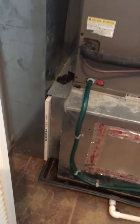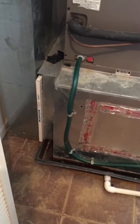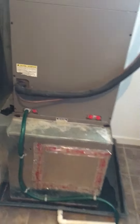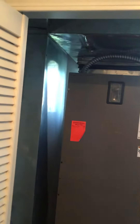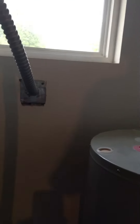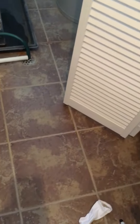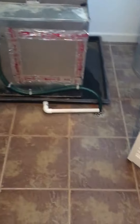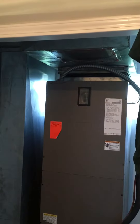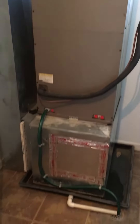There's a spacer in between here, air handler canvas connector, 15 kW, coming over and catching the wall here, line set goes up into the attic. The drain comes down and catches the floor drain right in here. She's had probably about four or five issues now and is tired of spending money on it, so let's look at replacing this entire thing.